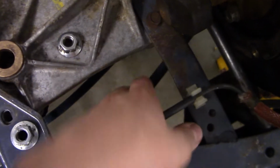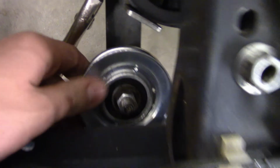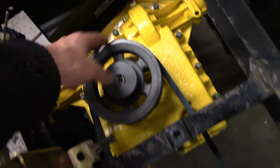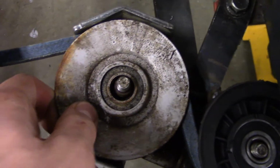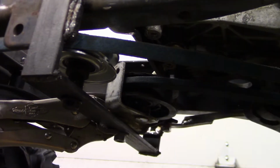This one is the one that's going to be driven, which will have the power going to the transaxle. And I just put this little pulley in there because before it wants to go in a straight line like that and hit all this stuff. So that worked out nicely. It wraps around the 5.5-inch pulley, back to the clutch, and I'm still ordering up the right pulleys for this, so that's not the right pulley. I'm going to get the right one, and then it goes back up to the engine clutch and my little idler pulley, and it goes up there to the 2 pulleys.